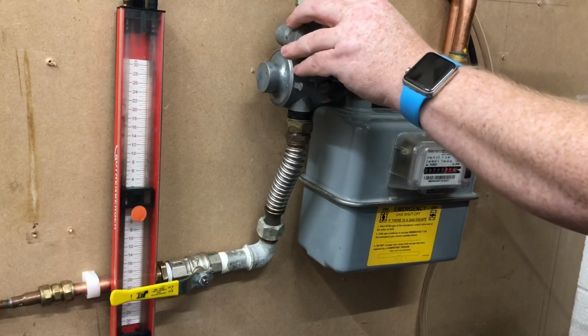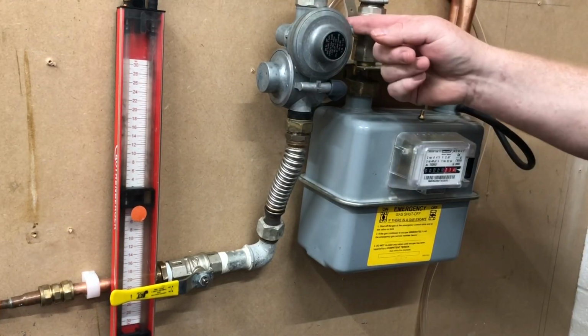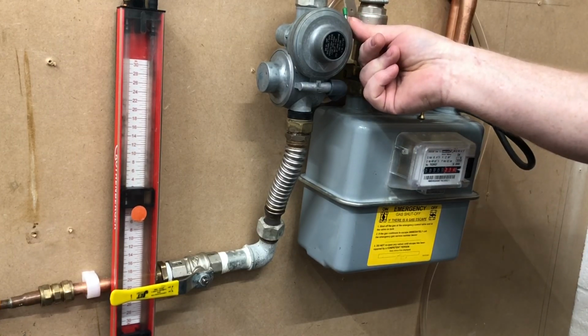Until we go to the system, we make sure everything on the system is off. And then we'd open this valve again, very gently, up to 7 to 10. And that 7 to 10 is testing for let-by again. And then once you've done that, you're then going to do that up to the 20, sorry, not 20, 19, remember 19 on this one. And then you can establish it as normal. And then the rest of the system, you do your tightness test as you normally would.